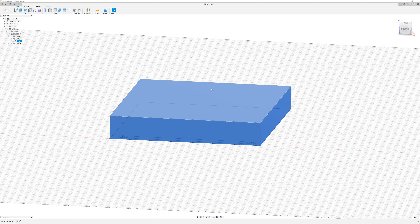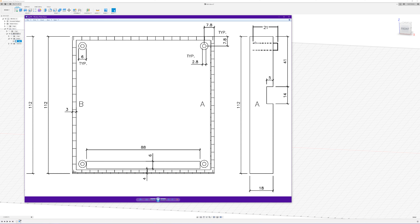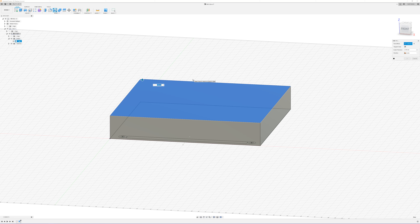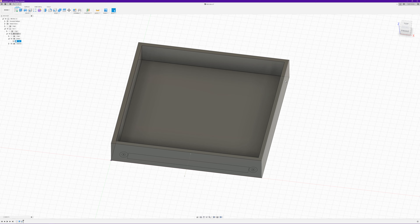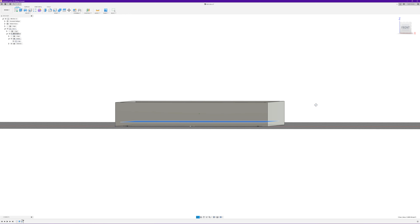The box itself has a wall thickness of 3mm. Although it didn't say, the thickness of the floor is also 3mm — we can pretty safely assume that. To make that, we simply select the top face and go to Modify > Shell, type in 3. There we go — nice 3mm thick walls across there, and selecting the base confirms it's 3mm from the base of the object as well.